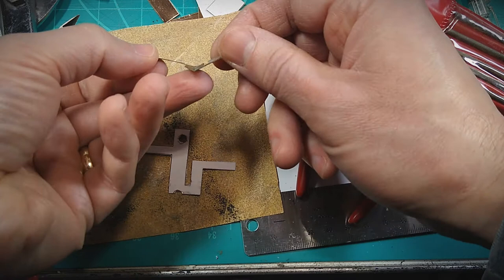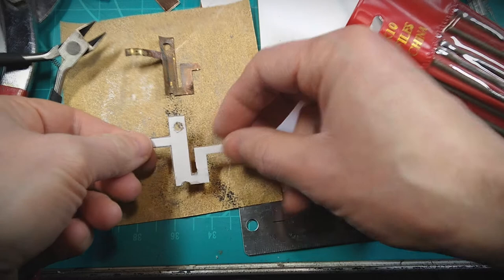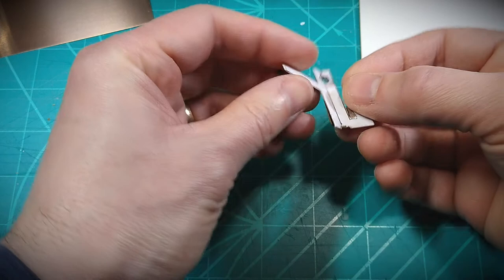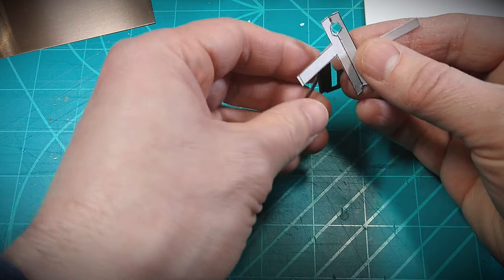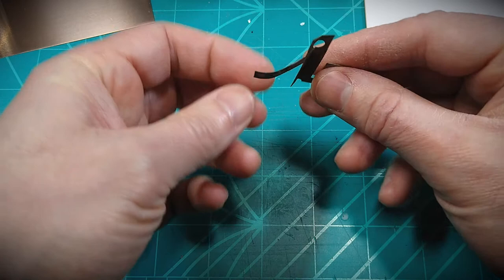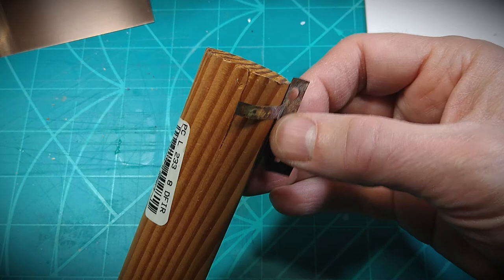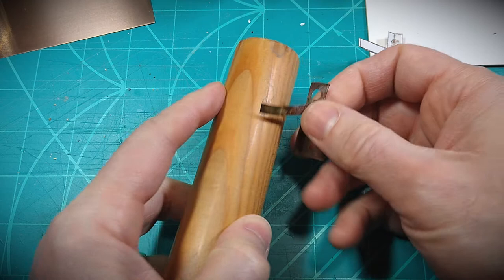There's a slight crease down the center of this strip, so I'm going to put this into a vise and give it a bit of a healthy nudge to recreate that bend. Putting in that bend just enough — it's actually a pretty close copy working by eye. I put in a slight bend, took it out, checked it, and tried again. It's better to go lightly than too much and have to try to bend it back. I'm using a rounded dowel to put a gradual curve to the outer ends of the terminals, using it as a starter shape and then tweaking by hand as needed.